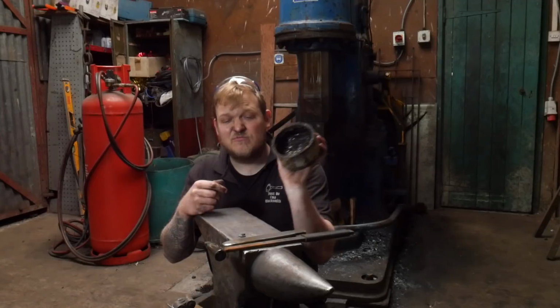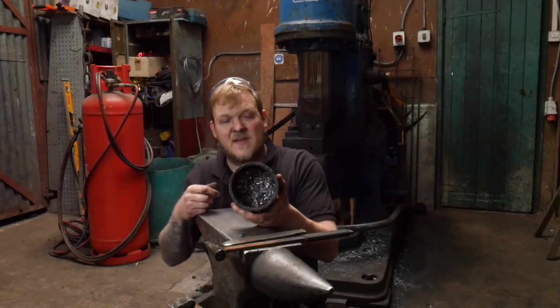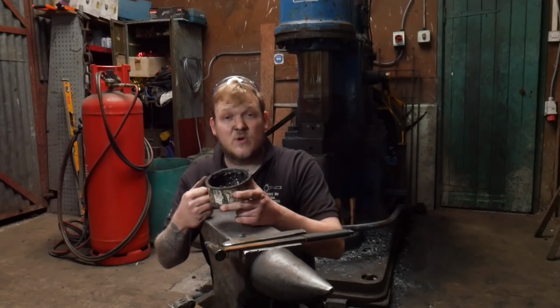However, this dries reasonably hard, so when you stick the punch in for the first couple of times, you have to wiggle it around a bit to get a bit of snot on there, but this stuff's brilliant. Definitely recommend making this up. Alternatively, just the beeswax on its own does work quite well.